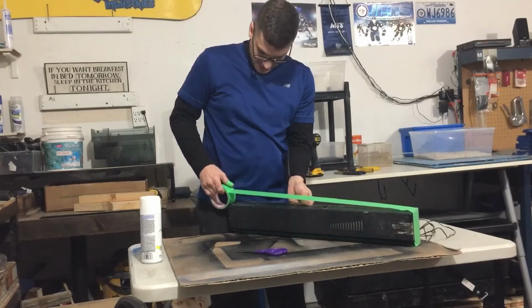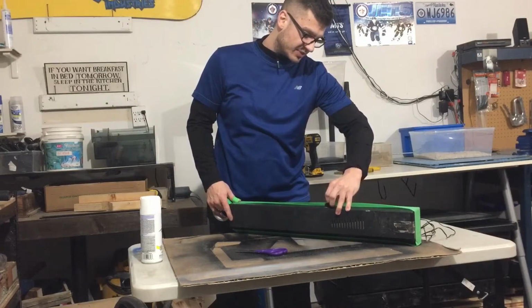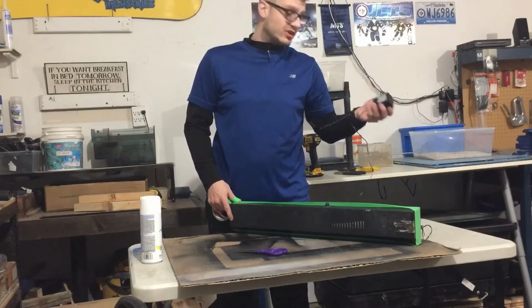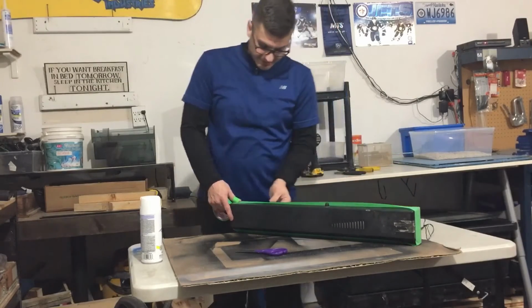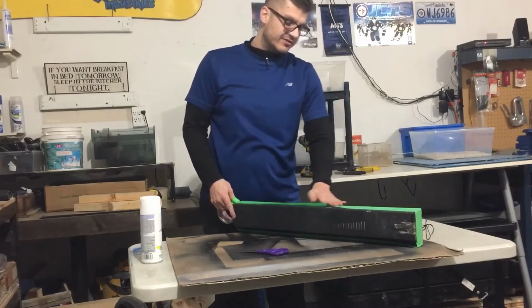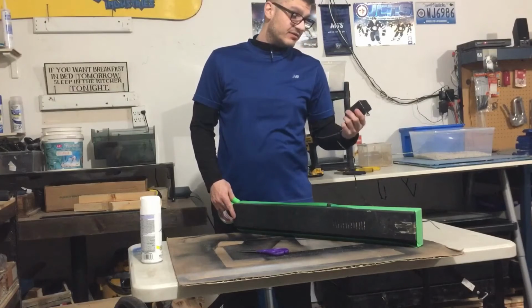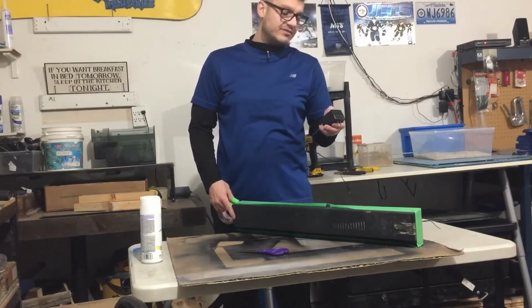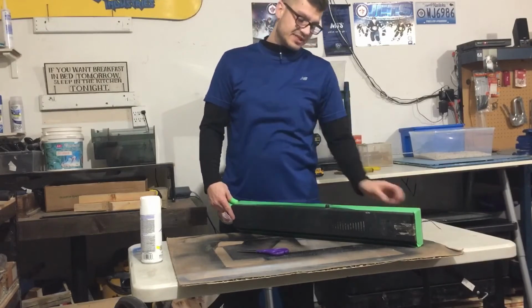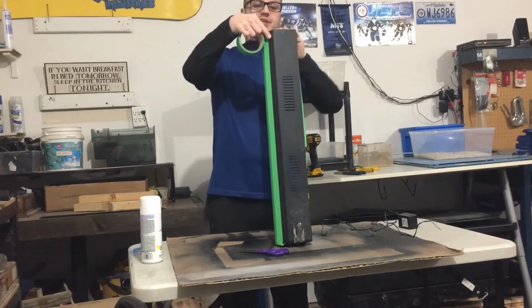It's in that section, and it requires a 12-volt DC power supply. So that's why I have this here. This is from, I have no idea, some sort of old electronics, but I use these because they're free. My mom had one of them lying around and she gave it to me, and now I'm making a light out of it. I've made a couple others with similar adapters, and as long as they're 12 volt output, they seem to work. They all have different milliamp numbers on them, and it doesn't seem to make a difference for these lights. It's just trial and error on my part, so if it doesn't work for you, try another adapter.